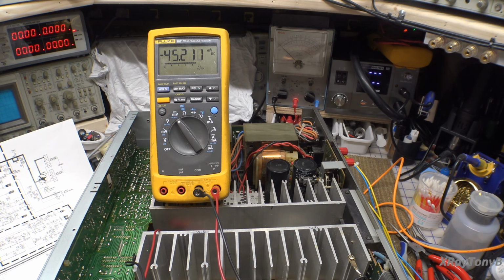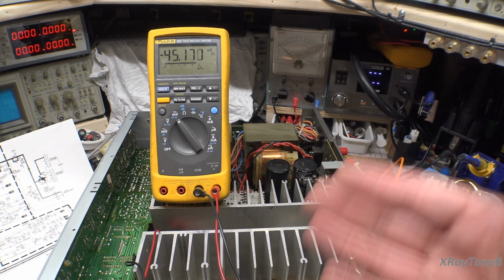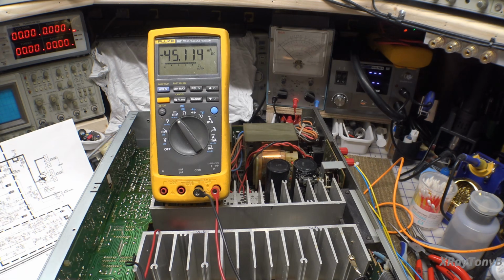And you'll see that higher end amplifiers, I've noticed this, where they do take care and try to at least somewhat match the output transistors, they will reduce the size of that emitter resistor. So instead of 0.33 ohms, which is 330 milliohms, I've seen them as low as 0.1 ohm or 0.22 ohms. And they can get away with that because, number one, those amps may be running lower wattage, they may be lower power amplifiers, or they may have better matched transistors, the tighter specs when they manufacture it.